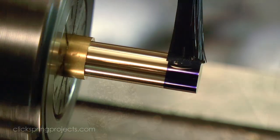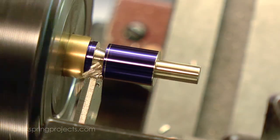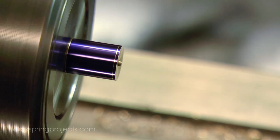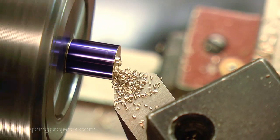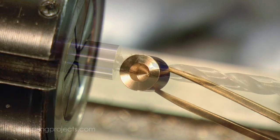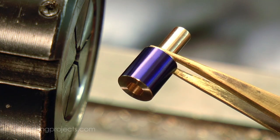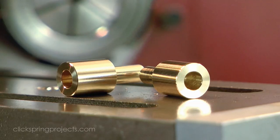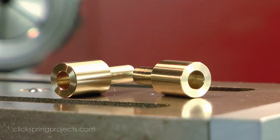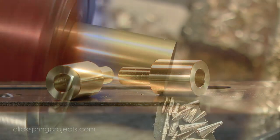Now most of the assemblies for this part of the gear train run directly in the main plate, but both the P and Q assemblies require raised bushings to bring them to the correct height for gear meshing. They're basically small cylinders that are intended to sit proud of the main plate, held in place with a pin and washer on the other side. And speaking of washers, I turn those next.